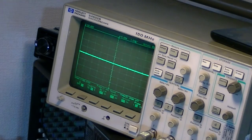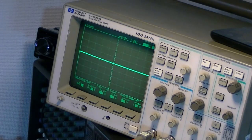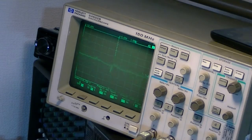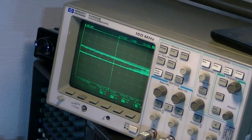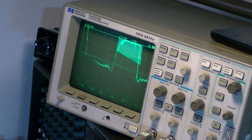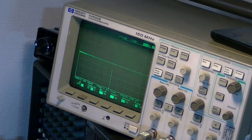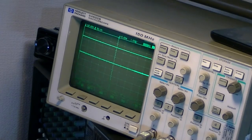Okay, yeah, everything is stone cold still, so I don't think we've got any risk of blowing anything up. So let's leave this on for a bit longer then, seeing as we've got nothing that's getting hot. So the switching is struggling to come on. It's clicking in and out very quickly. So I'm thinking this is a driver board issue, so I need to pull the driver board out again.